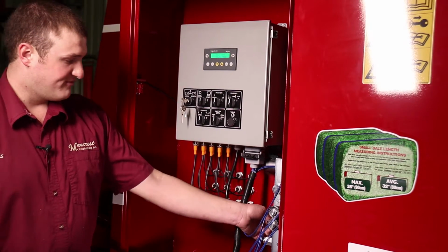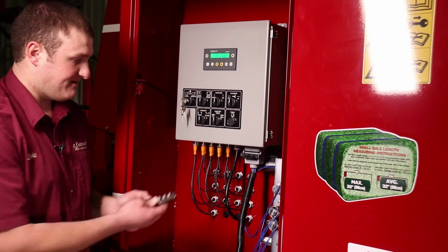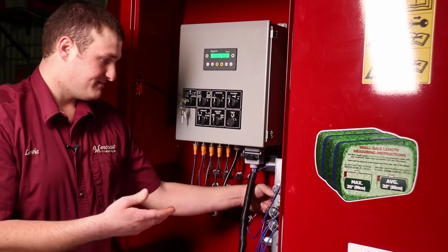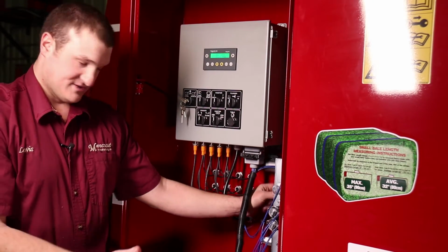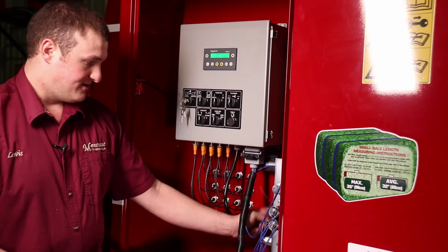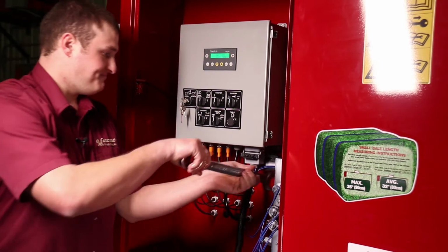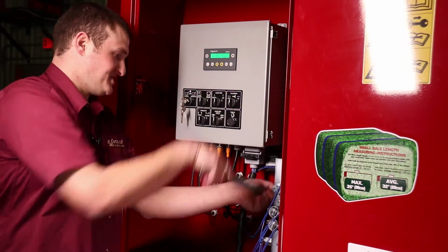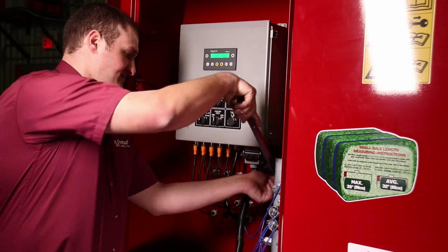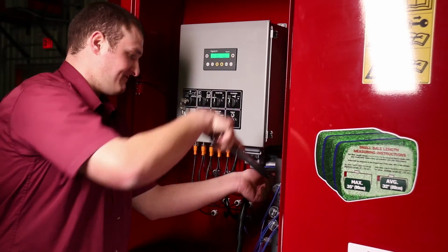Next, we would choose to remove this valve, replace it into this port, and then replace this valve into the port down here, tighten everything back up, and see if our problem is moved or resolved. If the problem's moved, then we would either replace this valve or just clean the contamination out of it. It's a judgment call you make at the time, and reassemble it, torque it up to roughly 70 foot-pounds.